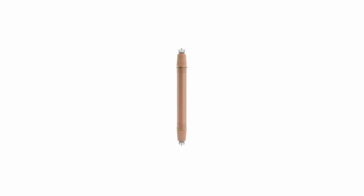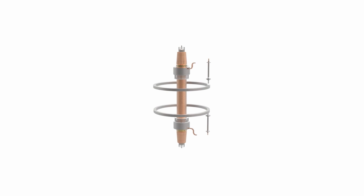Let's look at them separately. These are the divertor coils. They shape the magnetic field so that excess heat and particles are diverted to a strengthened area of the machine, where they can be removed. The merging compression coils will be used to start up the plasma, by creating the plasma current that the solenoid will then sustain. Merging compression is where the energy will come from to achieve the 100 million degree temperatures.